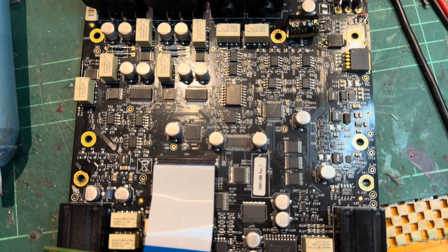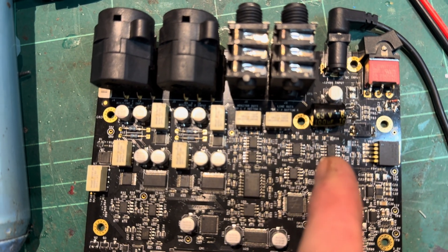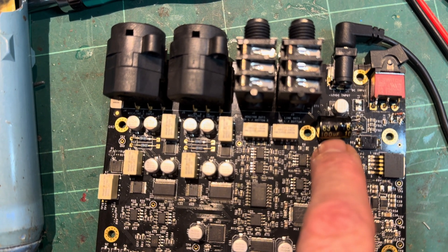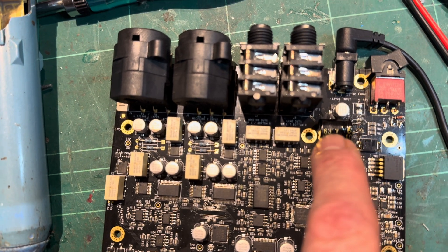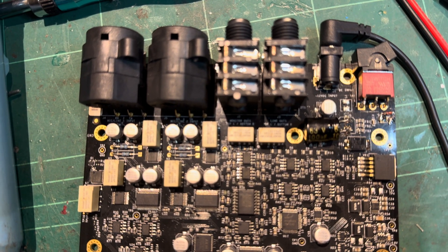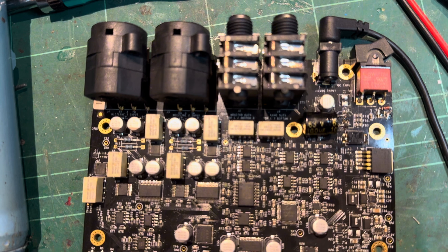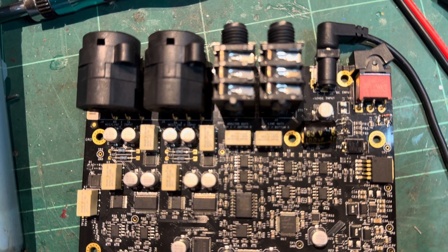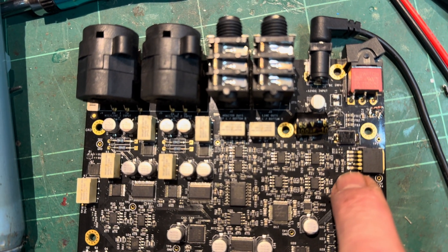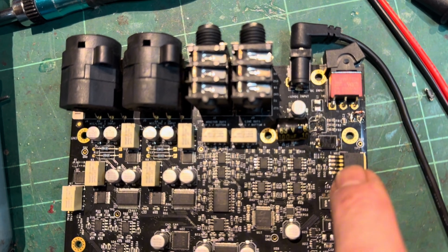After a little bit of exploring let me show you what I found. This is the power circuit — power comes in at 12 volt. There's usually a surface mount capacitor here which was a 35 volt 100 microfarad. I tested across that and it looked short circuit, so I thought maybe it had burnt out short circuit — which is unlikely for a capacitor to do. So I pulled it out of circuit, unsoldered it, put a standard electrolytic in, measured across the pads and it was still short circuit, so that wasn't the problem. This is a voltage regulator with output, input and ground — all those pins were shorted together, so something else is going on here.